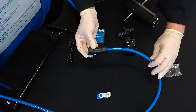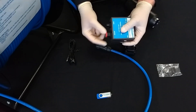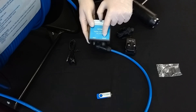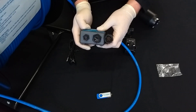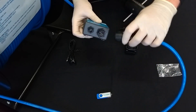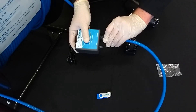We can now take this cable and plug it into the FMD topside interface box. Remove the protective covers from the two ports. The topside cable from the cable reel plugs into the port marked ISA500. Ensure that the orientation of the cable matches that of the port itself — there are some little key marks to make sure that this cannot be put in the wrong way around.